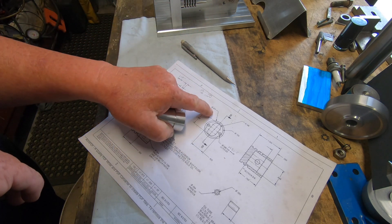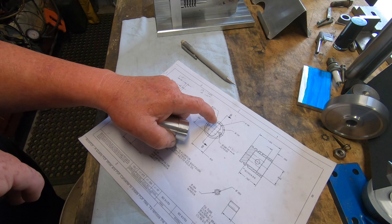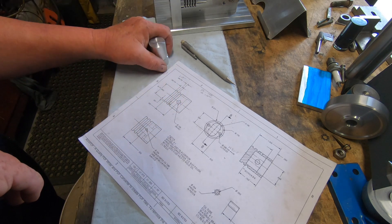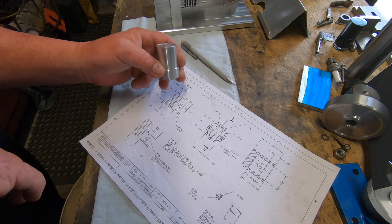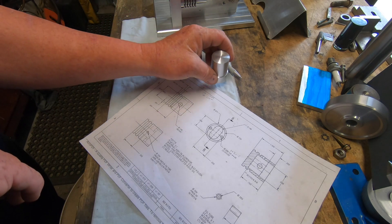It's 0.873 on the outside diameter, three-quarter bore in it, then the little oval shape in the guts, a couple of side holes — and that's about it. So I might as well get in and build it, and hopefully I can get away with building it once.